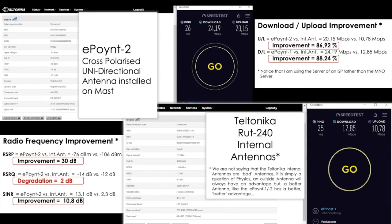That 10.8 dB SINR improvement is what I attribute to the 86.92 percent uplink and 88.24 percent downlink gains — showing how much an external antenna can assist with the same router and same contract, simply by moving it up on the mast. In a suburban area, when towers are too far to take advantage of omnidirectional capability but you have a primary eNodeB you can focus on, a directional antenna is probably the way to go. Thank you for watching — be sure to watch out for my next videos.